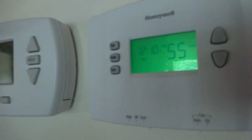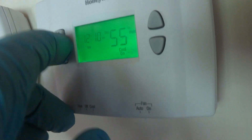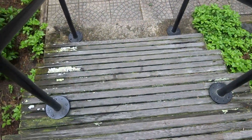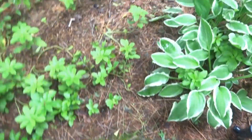I'll put it on hold. This is the one on top — AC here. Okay, AC, cooling on — 55 hold. It should come on. Who put this in? Mass Save. I can hear it running now. It's the second year we've had that — that's the air conditioning. That should have a five-minute delay for the outside unit. Fan's running inside now. So the fan's running. It was Mass Save coming and changing the thermostats. It should be on delay — it should kick in. It's a five-minute delay on that thermostat for the condenser to kick in, so let's give it a minute.